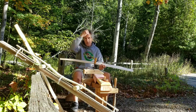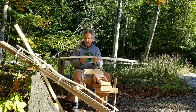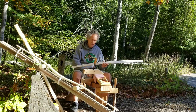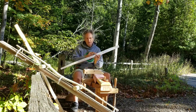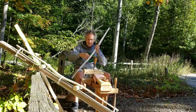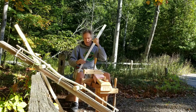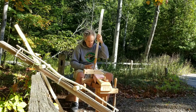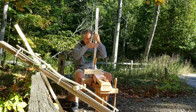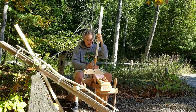Let's do like 1/3, 1/3, 1/3. 1/3 of the limb is a little thicker, then it goes to 1/2 inch, and then another 1/3 here that's a little narrower. You've got then on each half limb, 3 lines, a thicker one, 1/2 inch one, then slightly thinner, and then work it down to those using your growth ring pattern to have even steps from one to another, because you don't want to have thick, then thinner, then thinner. You want to grade it down, you want to taper it.